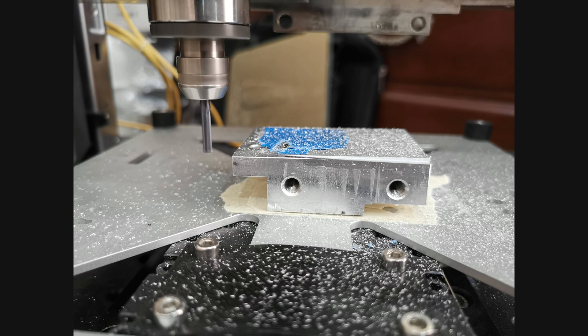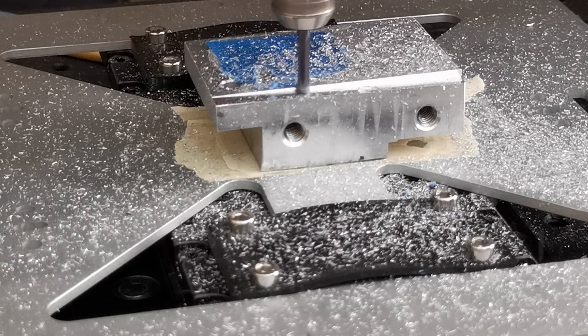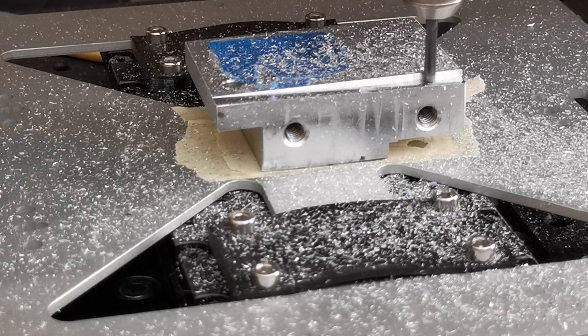In the following I am going to progressively increase the width of the cut as I traverse the part. The maximum depth of cut on the right hand side is 2.2 mm. I started with a step over of 0.1 mm and increased progressively by 0.1 mm.